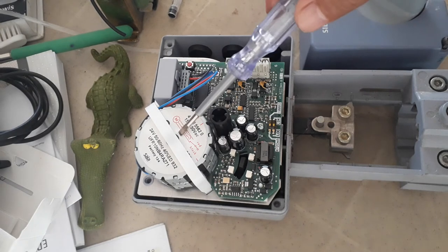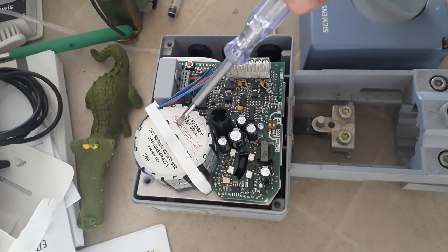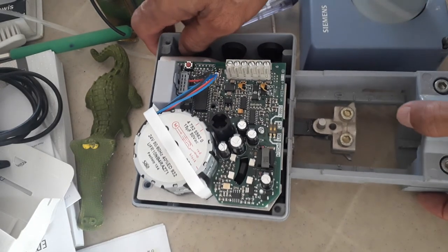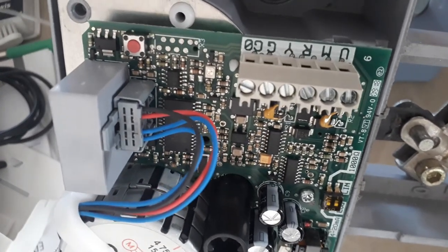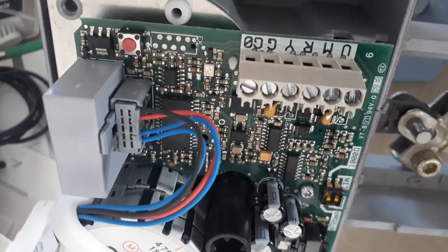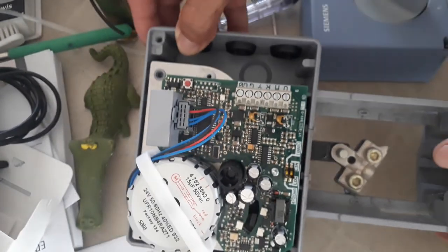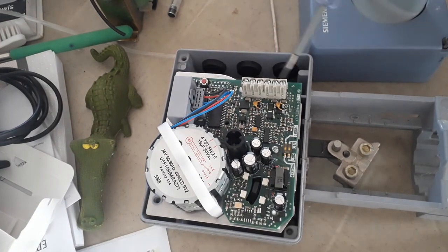You will see there is a motor to drive the valve to open and close position. The terminals, as you can see, are labeled U, M, R, Y, G, O, G, and GO. U and M — this will be the control or the feedback from the valve actuator. The feedback will tell the BMS what is the current opening or position of the valve.